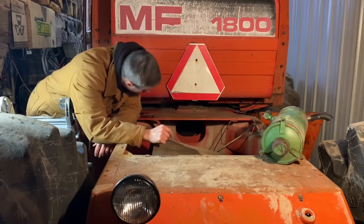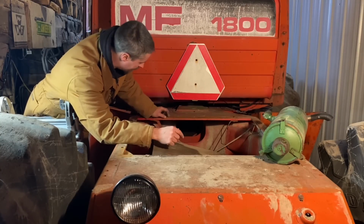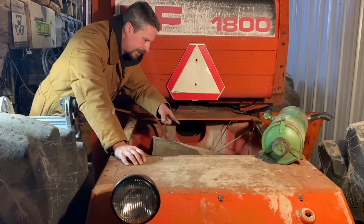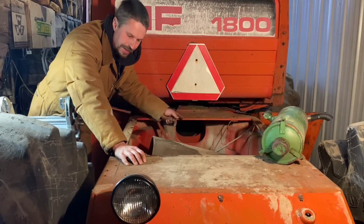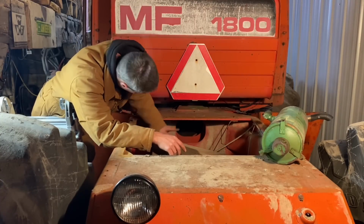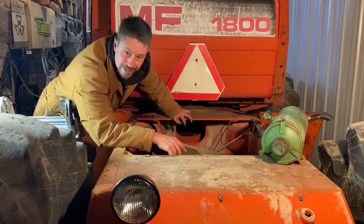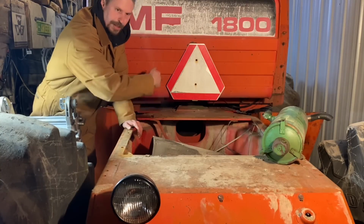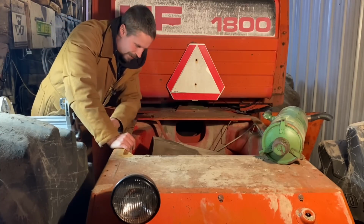Put my spouts over there. Now, the other thing, I know you're asking yourself, you're like, hey, JT, this tractor bends in the middle. This hose is going to be bending every time you turn. Very true. Also, consider there's 8 hoses, 9 with the brake hose, that all twist in this same area here. And I got a bonus for you. This tractor doesn't have PTO, but it's still got that about 10-inch by 8-inch hole for the PTO shaft to go through. So honestly, I don't think the hose is really going to be making very many sharp bends. And if it breaks, I'd rather it broke down here than up on the cab. Just thinking out loud again.